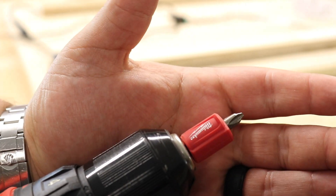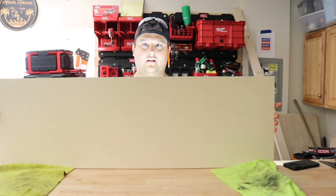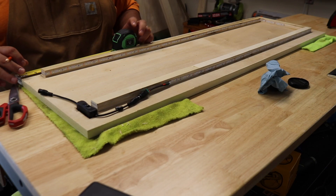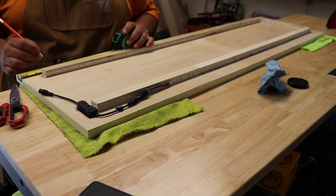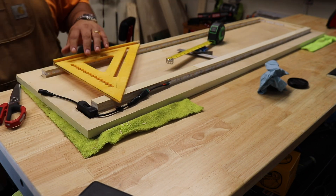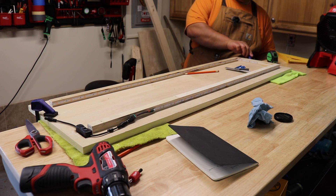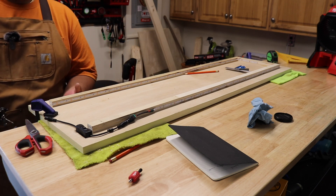I've got this little attachment on my Milwaukee drill that magnetizes any drill bit — pretty cool. Originally I was gonna do a routed channel here but it's really just not necessary. You can't get the full effect without a wall behind it, but just imagine — mounted on the wall it's gonna light up the whole thing. This thing is gonna sit four inches away from our outlet, and our stud location is eight and five-eighths away from our outlet, so we're going to drill a pilot hole at four and five-eighths. I've been reading Adam Savage's book lately and he has a whole chapter about addressing the workpiece — specifically about clamping things down and taking nothing for granted — so I'm trying to make better use of my clamps.